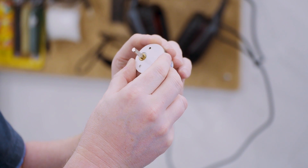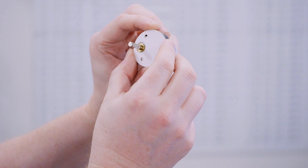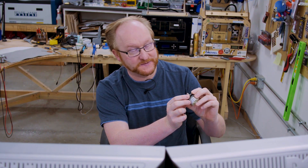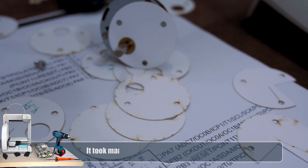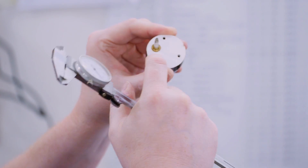This paper pattern is way off. Look at that - the shaft isn't centered. You'd think these two screws would be the same distance in from the outer edge, but for some reason they're not. Also the shaft appears to be a little bit to the left. Good thing I ran a paper pattern before I spent the time with a 3D print. Each one of these screw mounts is a different distance from the center of the motor, and the three of them are about 2.5 degrees rotated from the shaft.